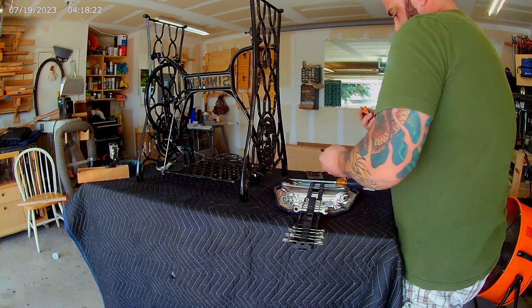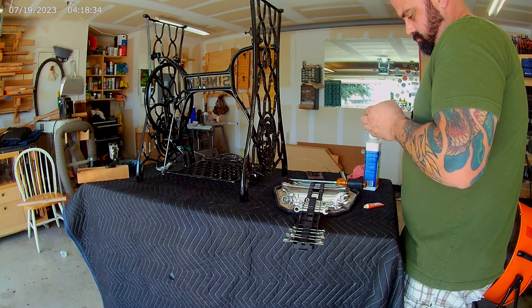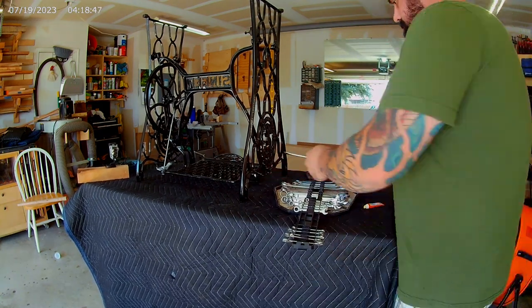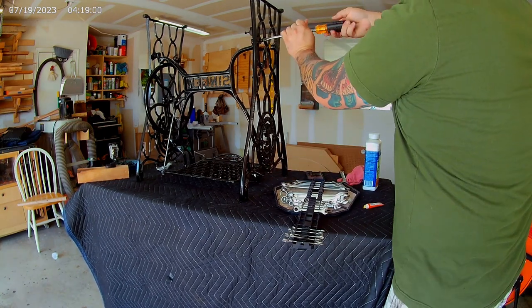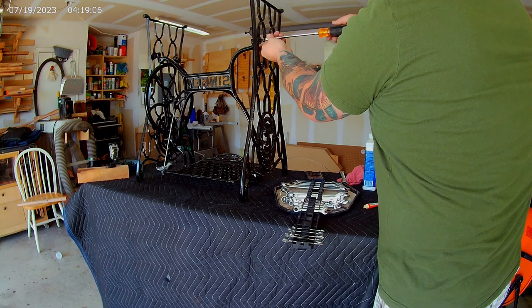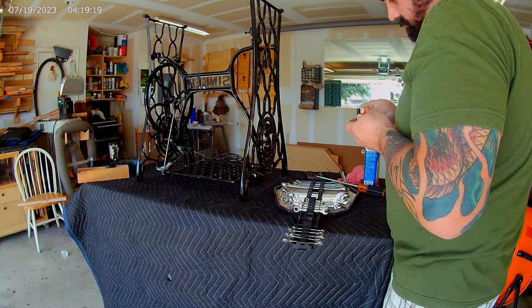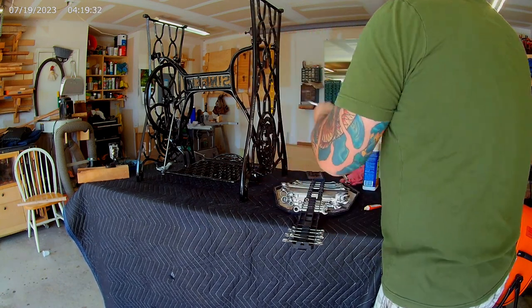You might be wondering, why am I removing the bolts that I just put in? Well, I am applying some of the softest Loctite to prevent the bolts from seizing in the future while holding over time. This stuff is easily reversible. I'm doing this one bolt at a time so that I don't have to completely disassemble the entire thing again.